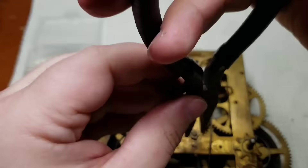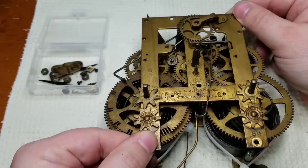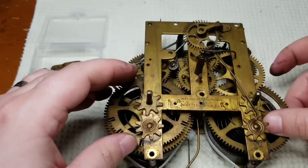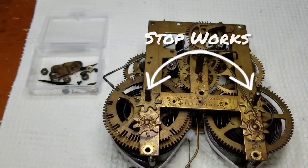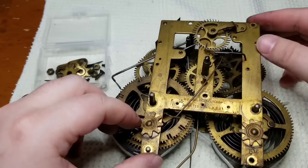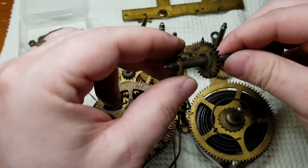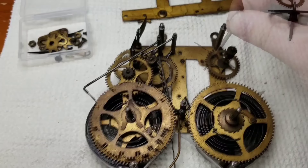This is only the second clock I've worked on, so I'm just figuring things out as I go. I don't really know exactly what I'm doing, so as you can see here I'm trying to take off the top plate, but there are these two gears called the stop works and they're kind of preventing the top plate from releasing. Once I get those popped off, the top plate just comes right off. Once that's off you're just left with a pile of parts and gears — it looks really complicated. I like to look at each part and see if there's any damage or anything noticeably wrong, and then I can start getting things ready to be cleaned.